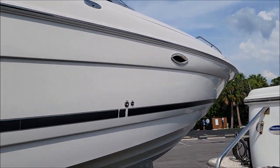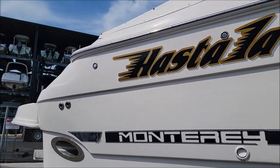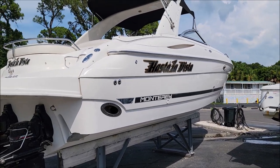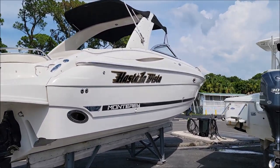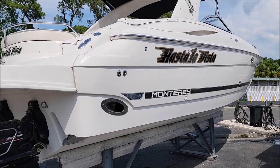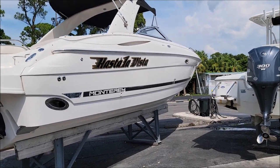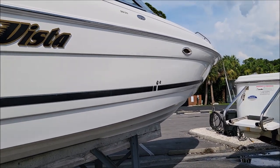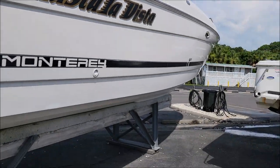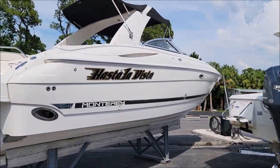Like I mentioned before, if they were going to keep this boat, my recommendation would definitely be to sand it, then compound and polish it out, and put a ceramic coating on it — or Infinity Marine, which is my permanent clear coat, so it lasts indefinitely. It's a permanent clear coat that basically makes your old gel coat look brand new again. If you've got a painted boat or if it's super chalky and oxidized, spraying on Infinity Marine will bring all your color back and make it stupid glossy. Infinity Marine is a polymeric resin one-part clear coat that also has ceramic in it — so it's a clear coat and ceramic coating in one. 30-footer glossification, boom.